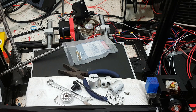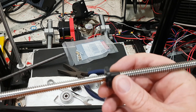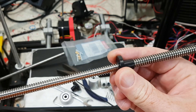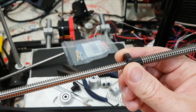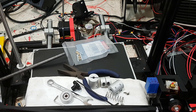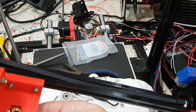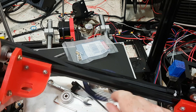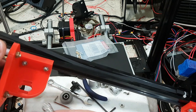The other option, as I've heard on AliExpress, is that you don't need an anti-backlash nut — you can just use a POM one, which is a plastic nut, and that's what this is here. This is super tight and has no backlash. In theory it'll wear out more — I would definitely grease it, but that's true for all of them. These spring-loaded ones don't actually fit in the standard system because the spring makes them a lot fatter, so they don't fit with the spring installed.